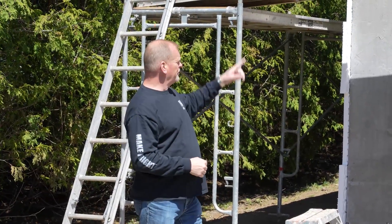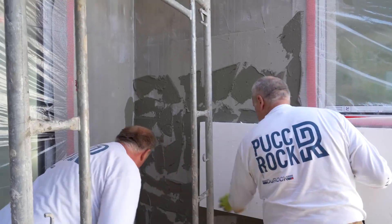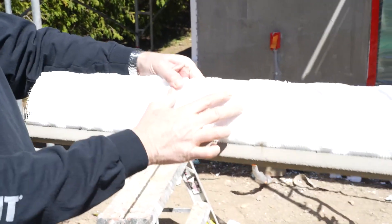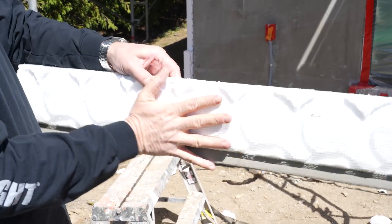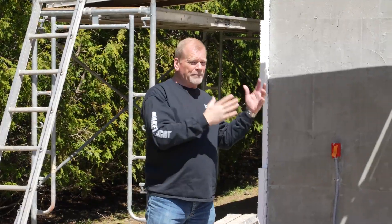Dasano and his crew are here doing the prep coats on top of the ICF, and a base coat on top for the new foam going in place. It has a puck system on the back — here's the bottom starter strip, finished all the way around. The puck feature bonds with adhesive directly to the wall foam over the protected layer. Adding two more inches of thermal break on the outside of the existing two and a half inches gives me such a high R-value that when cold winter tries to come in, it won't — and when I want to keep it cool in summer, it will stay cool inside.